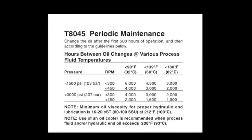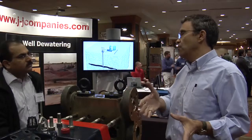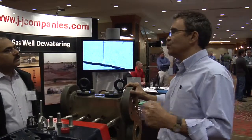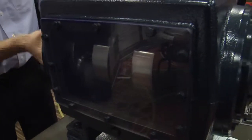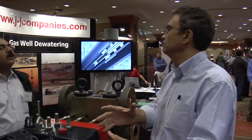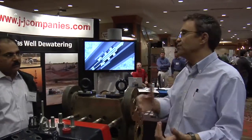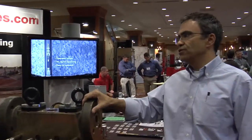We have a chart on how often to change the oil. One nice thing about this design versus typical plunger pumps is the crank bearing doesn't have to be shimmed — we use spherical roller bearings. The crank can be removed in three to five hours depending on pump condition, and reinstallation is much easier with no dial indicators needed. Our plungers are self-aligned into the cylinders.